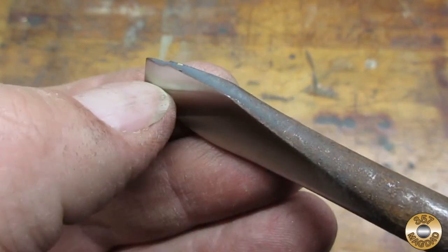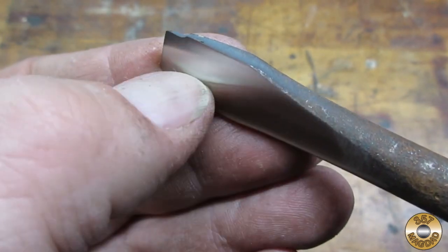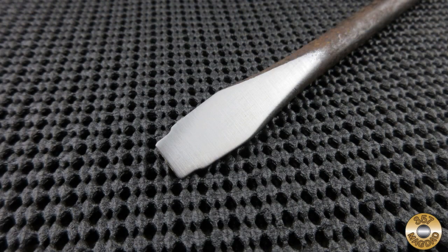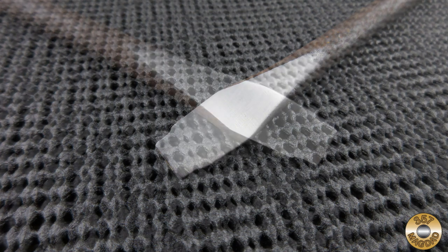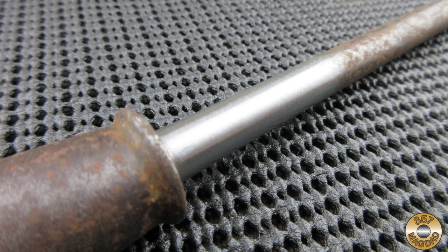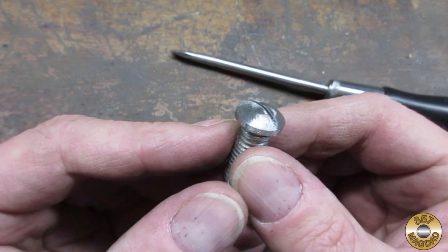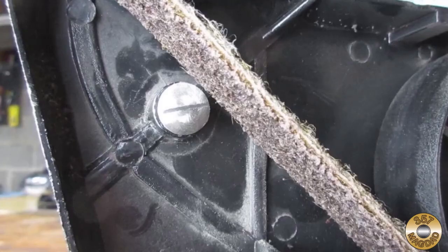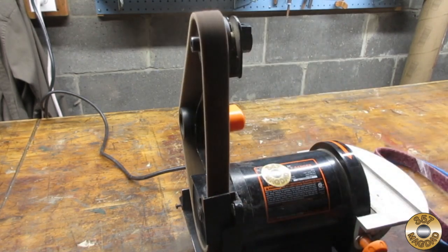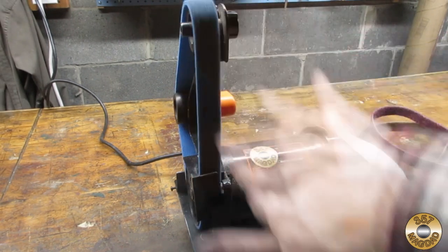I was pretty happy with how fast the three belts were able to produce a near mirror finish. I think the Red Label conditioning belts performed very well. They were able to take the sample sections of the old screwdriver from patina to pretty very quickly. I had to make a minor modification to my WEN machine so that the thicker belts had enough clearance. Machines by different manufacturers may require similar modification. Having to give the belts a jump start is not a big issue for me. I think I've had this happen a couple of times with brand new sanding belts. Obviously you want to be careful when jump starting the belts.